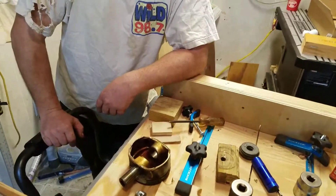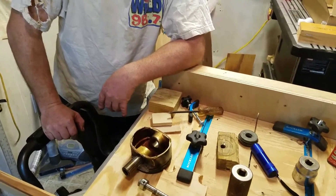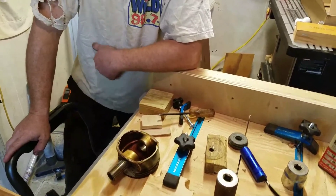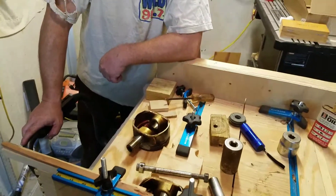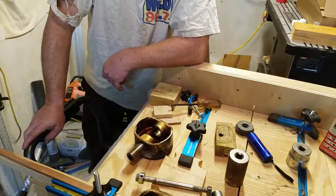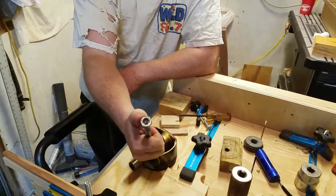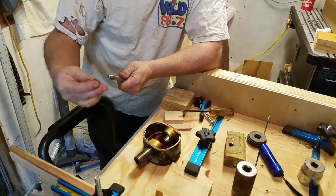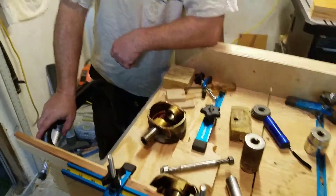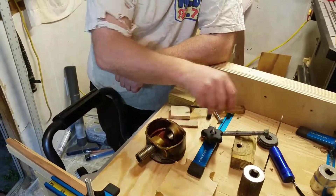We finally got the rods off without taking them to a machine shop, just by using some brute force and turning on the bolts. Some people in videos use power assist, but I think power assist doesn't help — it just chews things up, builds up heat, and can twist the threads off the bolt. You've got to make sure your threads are all lubricated well, and that the surfaces that will be slipping are properly prepared when you torque up the screw to pull the pin through.